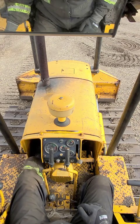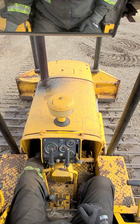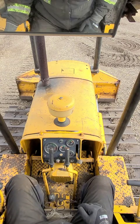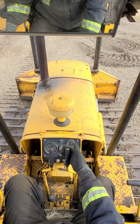The pedal I'm stepping on now, which is above and in front of the accelerator/decelerator, is the declutching pedal. Stepping on this releases or disengages the forward/reverse transmission, putting it into neutral even though the lever is saying forward or reverse. So you step on this to disengage power from the tracks, allowing you to shift your gears or run your forward and reverse, and then when you let it go it will engage again. It's sometimes called the inching pedal.